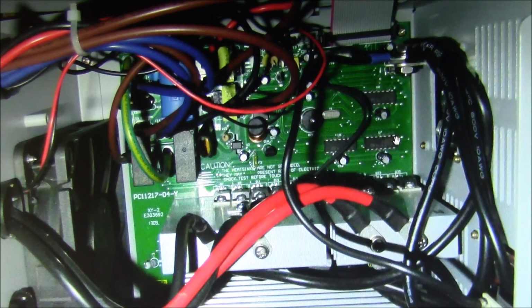and with all these heavy gauge AC wires soldered on top, I've really never attempted to remove this circuit board to look on the bottom side, but I'm guessing there's probably some surface mount control components on the bottom side, because I don't see anything that looks like a microcontroller on here. There's a little crystal and looks like probably some driver ICs.